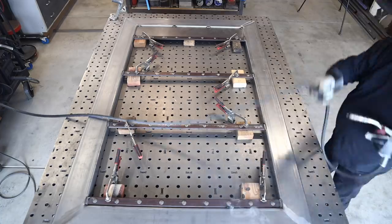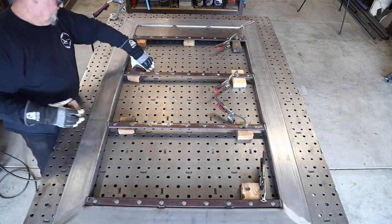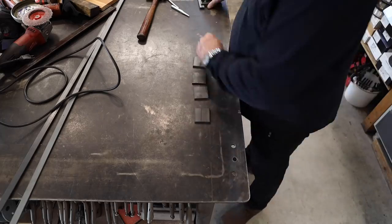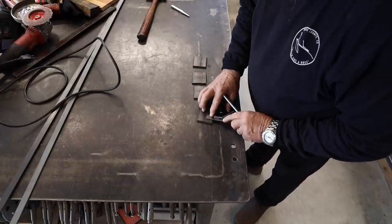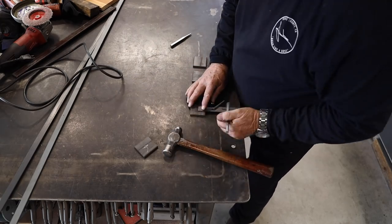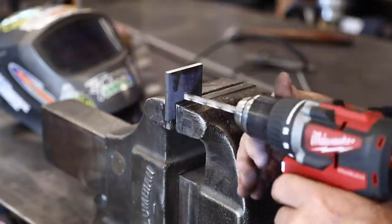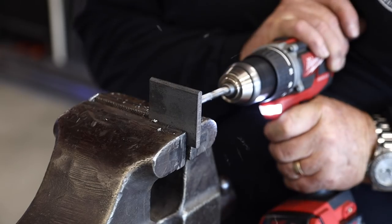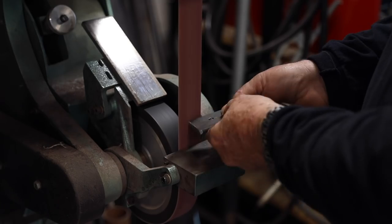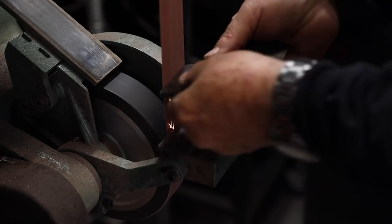You often wonder how they did these things back in the day — how they made everything, probably all by hand. They got some pretty cool gates back in the early centuries. I save a lot of my metal cutoffs, and here's a good example: this is some quarter inch by two inch by two inch flat bar — drops left over from something. I thought I'd hang on to those; you never know when you're going to need some quarter inch two by two pieces. This is going to be some decor added to each corner. I'm going to drill through the center here, and I've got some bigger clavos left over from a previous project. I'll cut those off, weld them on, and then I've got these over to the buffer just to soften up the edges a little bit and make them smooth.